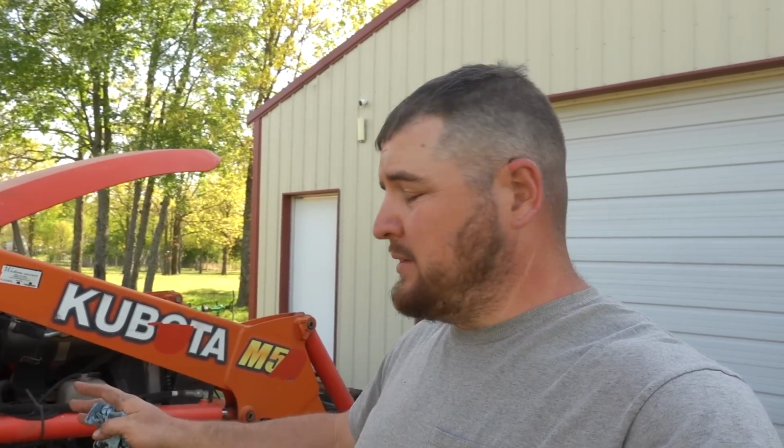Okay, the oil's done, and just a quick reminder, when you think it's full, you got that oil capacity in there, go ahead and start it up, let it run for 30 seconds or so, shut it off, and then check it and make sure that it is right on the dipstick.